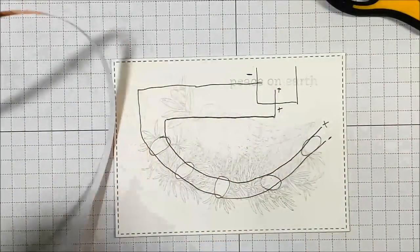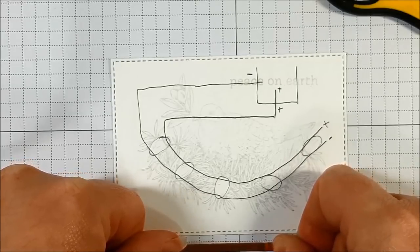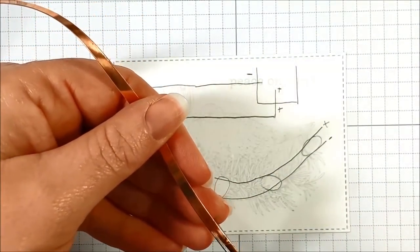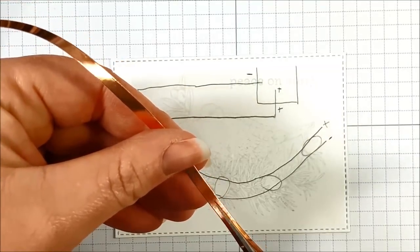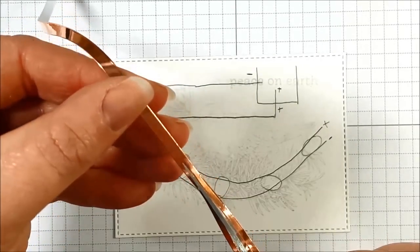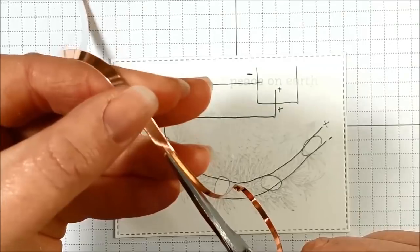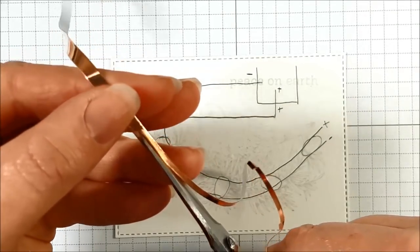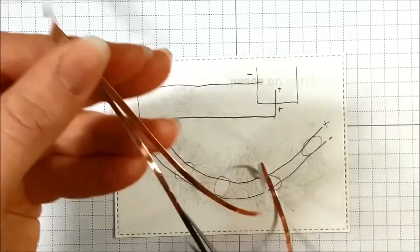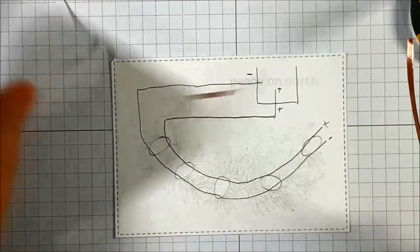The beauty of this tape is that it is approximately not quite a quarter of an inch in width, but you can actually cut it in half with regular scissors, splitting the copper tape nice and slowly. Try not to bend it until you actually have to place things down. Cut a fair amount — more than you think you need. You want to try to avoid putting joints in this product because it makes for circuits that don't necessarily work.